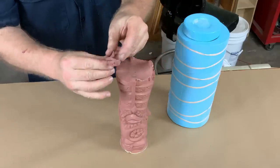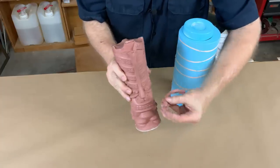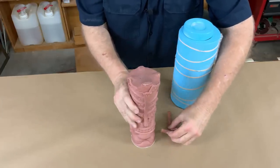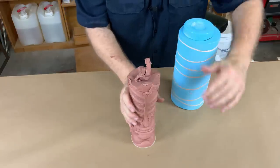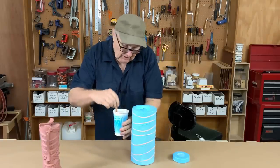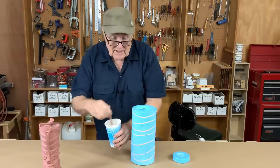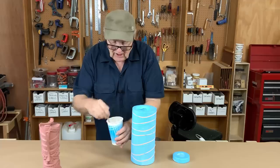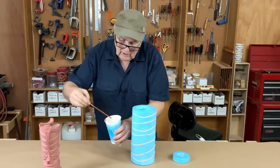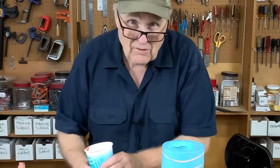Here's how the piece came out of the mold. As you can see, it sustained a little bit of damage up on top. I expect to wreck or damage clay models when they come out of a mold, so that is not unanticipated — nor am I sad about it, it's just part of the process. I mixed up a 200-gram batch of resin, and that's nowhere near enough to fill this thing up. But what we're going to do is a hand slush cast. A lot of my regular viewers are going: slush cast, why don't you put it on one of your rotating machines? The answer is I don't have time — this thing's due this morning. I poured it yesterday, this is a very quick job. I only need one of these today to ship to the factory, so I really don't need a rotating machine.